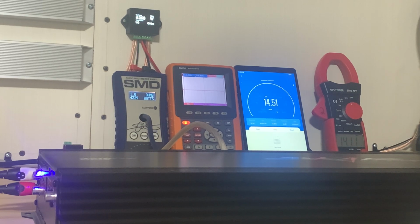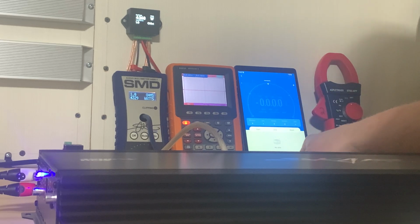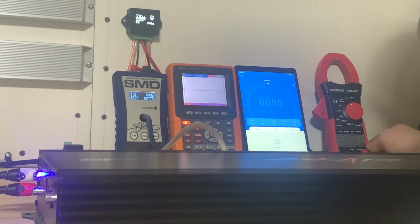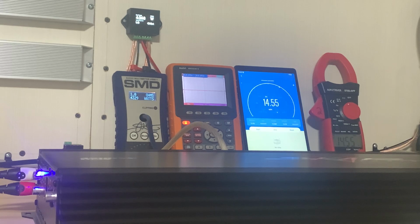All right. Test number 1, base head garage watt meter 4268. AMM1 is 4329. And well, something happened here. We're at 14.11 volts. 14.11 volts is right here. So let's go back out here and then clamp meter 2. I guess the Bluetooth connection lost connection there. But we were at 14.11 volts. There's the minimum, there's the maximum. We were at the minimum, so let's turn it off and then turn it back on. I think that's what the beeping was. So, yep, we're at minimum. All right, so let's clear this stuff out.